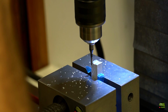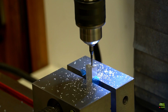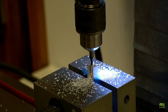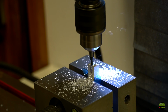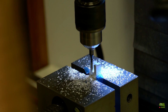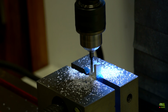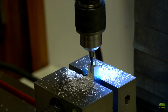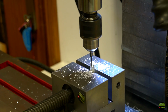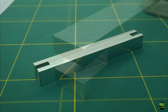I make it 10mm deep and about 4.1mm wide, so the bearing can run smoothly. I use a 3mm mill here, and after the groove is made I can easily extend it to the measure I want. These tiny mills always shift a bit left and right when milling, so if I use a 4mm mill I get a groove about 4.5mm wide in a single go, and that's too much. When you're done, repeat that also on the other end, to get something like that.